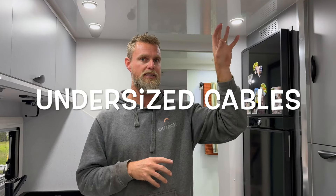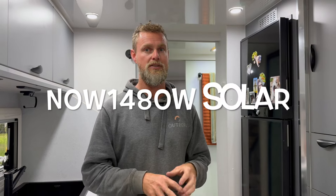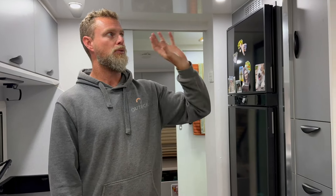We had a look and found that the cabling to the roof was probably a little insufficient, so we've recabled the whole lot. Plus we've added another 800 watts of solar - they've now got 1480 watts of solar on the roof. This is a 23-foot caravan so there's significant roof space up there. We've added four 200 watt panels to another 45 amp Tri-Star, and that's now all cabled up through the Simarine system.